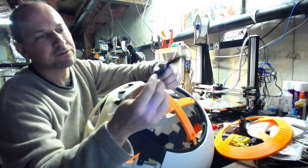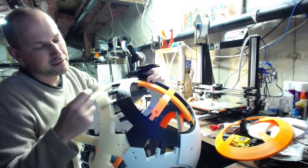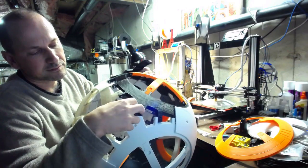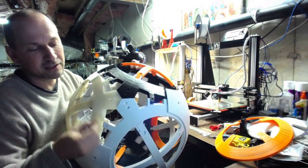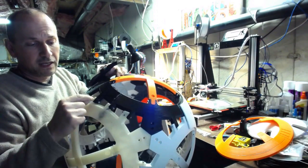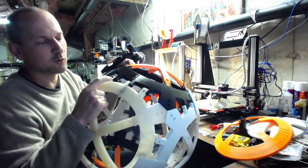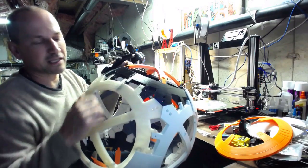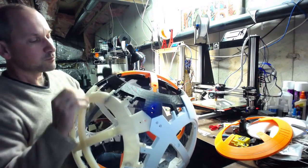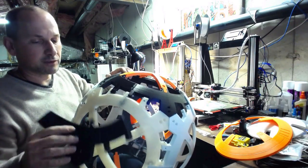There are a number of different little prongs on here, and these prongs are used to hold it together. Once they go together, you have one, two, three prongs, and then an axle joining plate that goes on the inside. There's stainless hardware that goes in there — you can either use a nylon locking bolt or heat-press in your hardware. It all bolts together with the washers, and the cool thing is you can actually take it apart again if you wanted to.